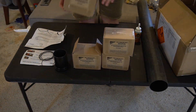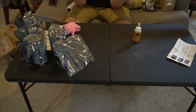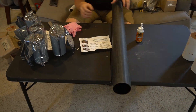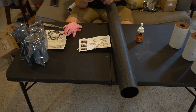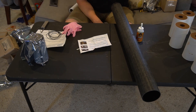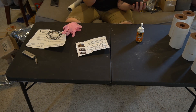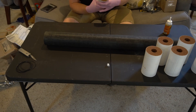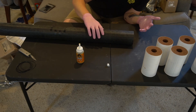The next step was to get out and unbox all six of the propellant grains. This is one of the more intimidating parts because if you mess one of these up you ruin the whole motor. Carefully remove them all from the boxes, and the most important thing is to test fit all of them first. Make sure none of them are tight fitting in the liner — you want them to be able to slide through relatively easily. Once confident all the grains were easily sliding through, I put on the manliest pair of pink rubber gloves I could get my hands on — no pun intended — and began gluing them in.